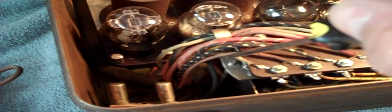The three nuts from the rods that run all the way down through and out the bottom of the cabinet, the nuts are off, and they all have ground wires hooked to them, almost all of them. So you want to be careful with those ground wires, because the rods have to go down through. And this one here has a ground wire that runs from this box on the left across to the box on the right. If in the process of picking this thing up, you don't want it to separate. You got to kind of keep it together, because if it separates too far, you could yank that ground wire right up out of that tar, and then you'd have to go digging, and we don't want to do that. And then of course the last one is underneath this mess of wires right here.